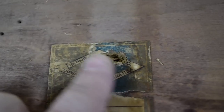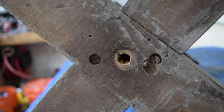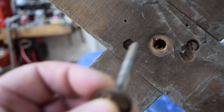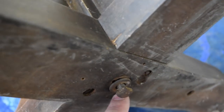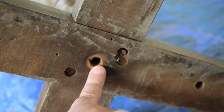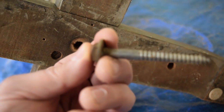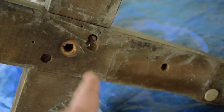There's a big old screw hole right through the label. Nothing earth-shattering with the legs taken off — it doesn't look like it's ever had a different set of legs on it. The screws holding the bottom leg assembly, the cross, to the decorative cornices were all tight. But this main lag bolt that holds it all together to the upright — running through and holding these legs to this portion of the turning — that was stripped out and we have to fix that. I'm going to get a dowel, glue it, pound it in, and we'll re-drill and remount this square-headed lag screw back in here.